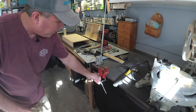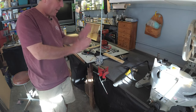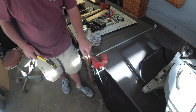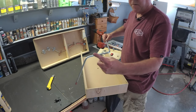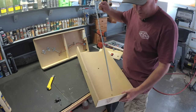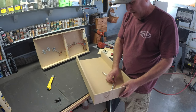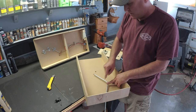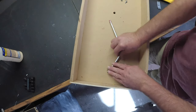Five inches from the first bend up to the top, and we're going to make a 90-degree bend so we can have this pop up through the surface of the table. That's going to work. Here's the bar — we've got a little bit of an L-bend in there, not a full L, and then about a 90-degree angle. So we're going to put it up through the hole that we drilled towards the back of the table, and now we're going to mount this to the underside of the table. Since the 90-degree angle on the bar is a bit rounded, I had to shave off some wood on the underside so I could mount the bar flush.